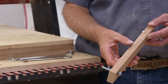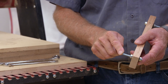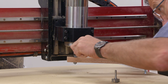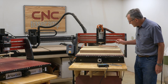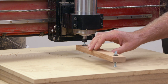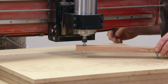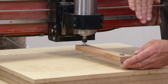The tramming jig is just a piece of one-by-two, about 12 inches long. I've got a machine screw on one end with the head, and on the other end the same machine screw with the head cut off. We're going to chuck it into the machine, carefully lower the spindle until the bolt is just a little bit off the surface. My trammel's in place and I have it just dragging on this side. Now I'll rotate it and see what happens — it's rising quite a bit over here, with a large gap between it and the spoil board, and towards the back there's still a gap. That's telling me my spindle is leaning quite a bit towards me and leaning back a little.